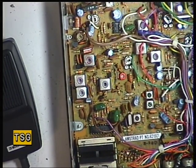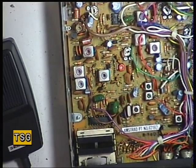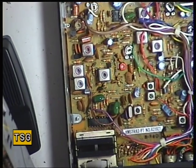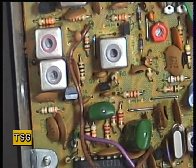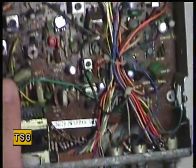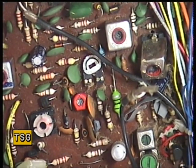That now covers it apart from the squelch. Now this is what works well on the genuine Japanese Amstrad and doesn't work well on the cheap copy version. There are two Hong Kong versions and one is a pirate copy. If you compare the boards — on this genuine one you can see all the component legends are screen-printed on the PCB. Compare that to this copy: the board is just blank and it uses poor quality components. So that can be the difference; that's a scrapper — we don't normally do much with those.